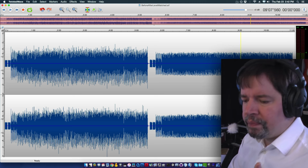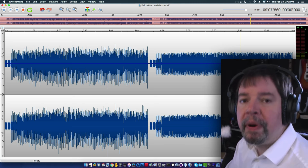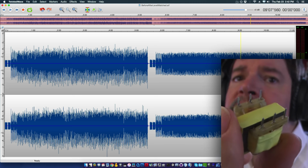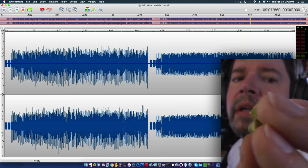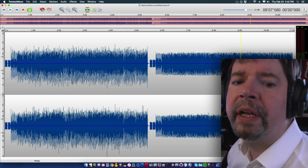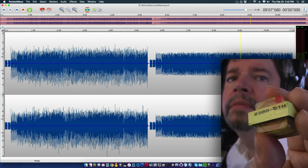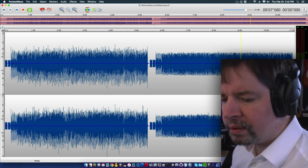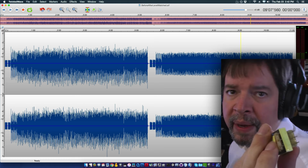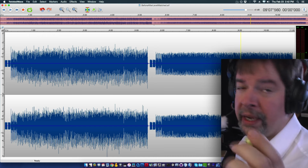Here's what we're doing. The Infundibulator is done by basically misusing a transformer. Here is a transformer. This is nothing but a little coupling transformer. It is 3 different windings. All of them are about 600 ohms. Now this is larger than the transformer I used for my Infundibulator.